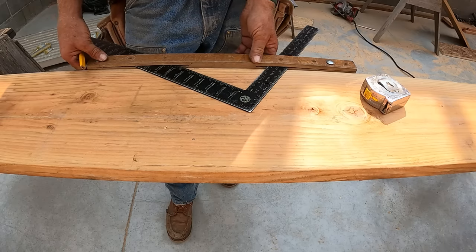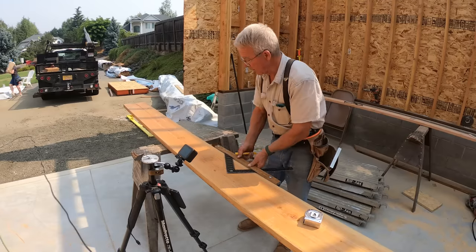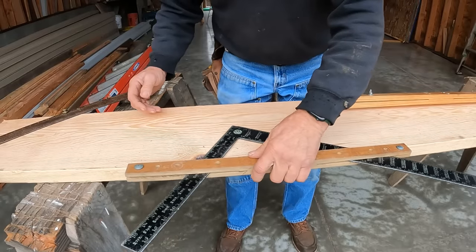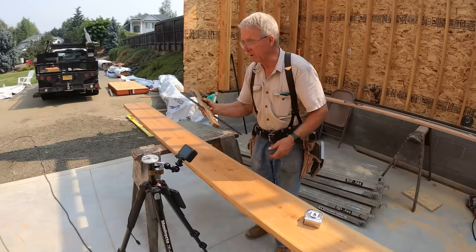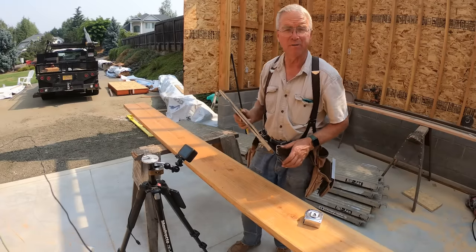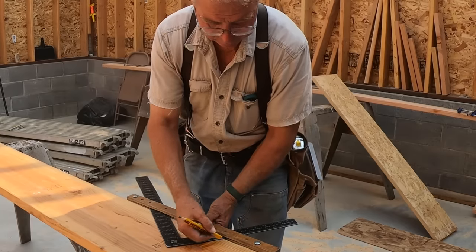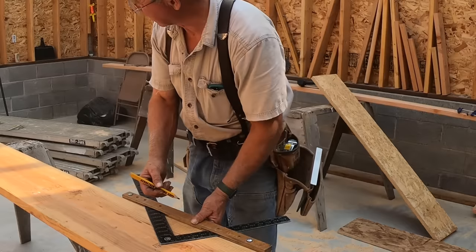It's important to get this perfect because with this square fence, which is what this is called, you can slide up and down and you can span the knot holes. You don't have to worry about wane. You can go right off the edge of the board getting consistent marks. If you've got time to set this up, it's the way to go. So I'm coming in past the defects, and I'm going to start in. Not to bulge, I don't think I could. Yeah, there we go.